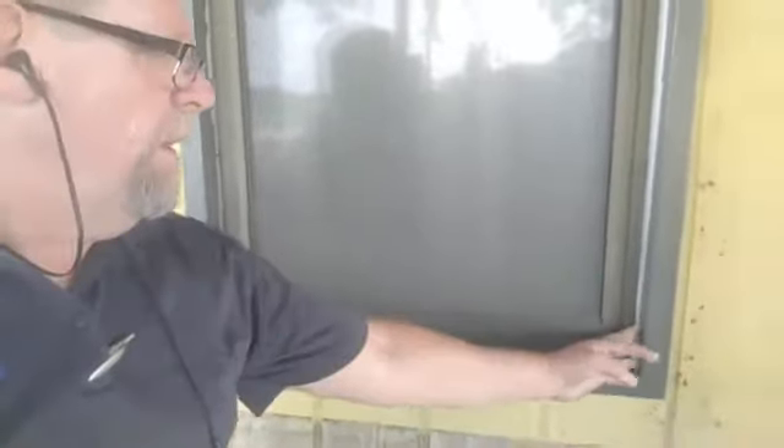As you can see here on the top fascia and right over here on the windows, we actually take and custom wrap each window sill and sides. Then when we run in here with the vinyl siding, it makes a really nice finished look. This color will match the siding — we can get any coil we need to match those up, or some folks like to put a little contrast on them, like a lighter color against a darker siding.